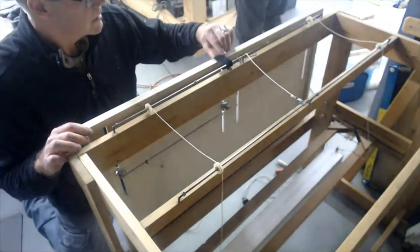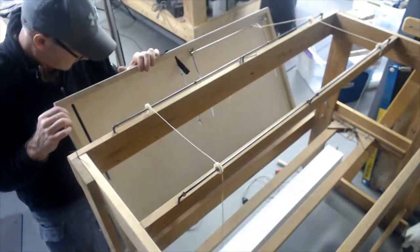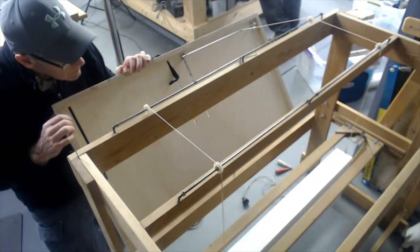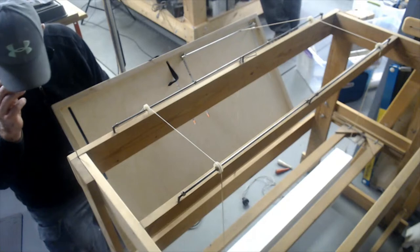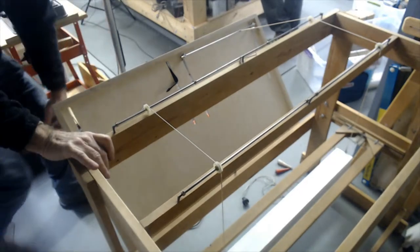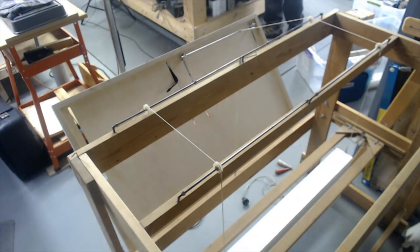The guy that was sitting there asking about an easy startup way, you can go online. If you got any kind of electrical experience whatsoever, you can make a power supply for one of these bows. It's basically a 12 volt car battery charger with a light dimmer switch hooked to it to vary the output of the charger. It's done a little bit cleaner with the commercially bought ones, but I've built them. There's tons of different ways to do it on YouTube.